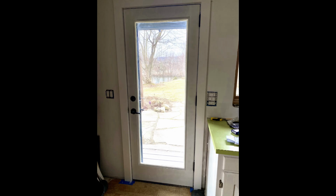That seems smart. Did it screw up any of your trim or cabinet details? No, because I'm kind of starting everything from scratch. The countertop's plenty deep, so adding a 1/4 inch isn't going to hurt anything. I did have to pack out the trim around the door. Instead of using 3/4, I went with 5/4 trim around the back door because the tile will butt that, and it would have been flush instead of set back from the door trim. That's the only thing I really had to deal with. Luckily, my kitchen's kind of chopped up, so a lot of the decisions I make don't affect other surfaces as much as they might in a more linear situation.